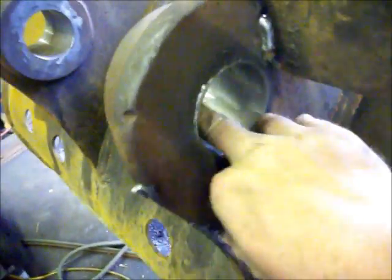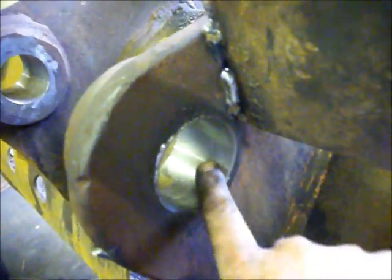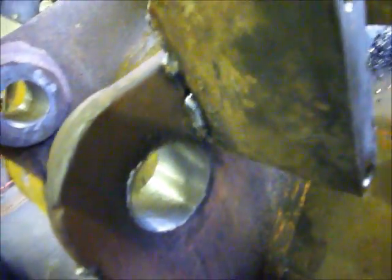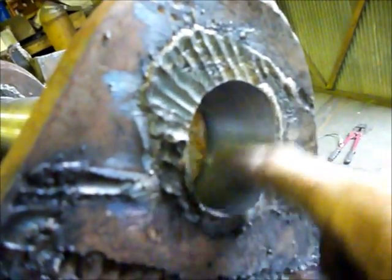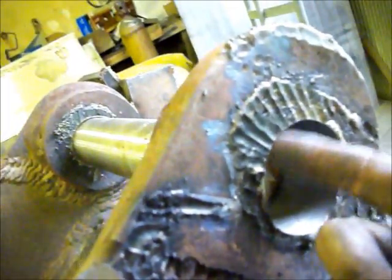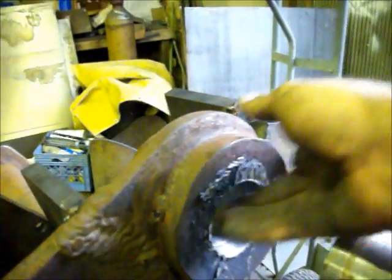These aren't exactly done, but you can see how smooth they are. I usually take a flap wheel and buff them up and shine them a little bit, and I've got to grind a little bit of this off too. You can see they turned out pretty smooth — they weren't too bad at all. A lot of that has to do with your cutter and how good you got the weld laid in there. This hole here that was in such bad shape has now been bored. All this will be ground off. I had to build a lot up here and the same way over here — I had to do a lot of buildup on top.